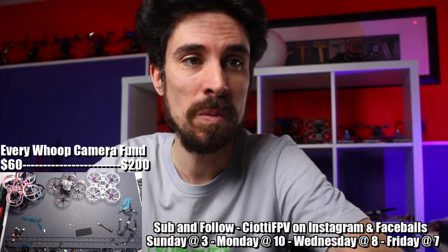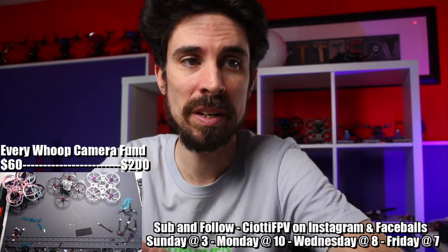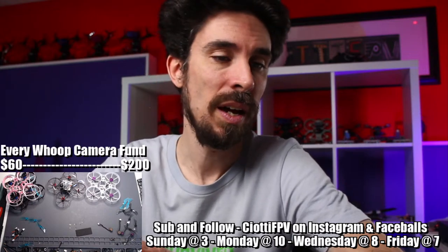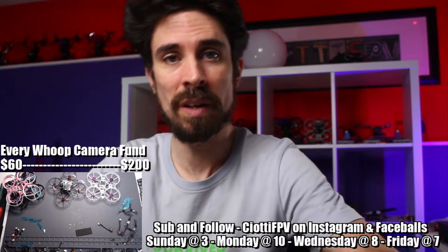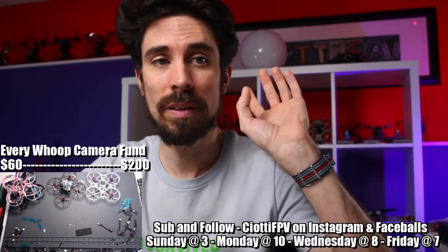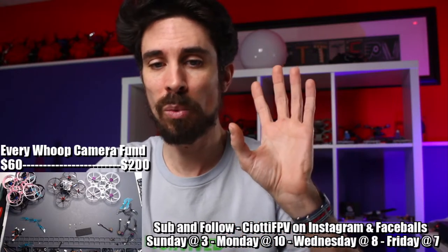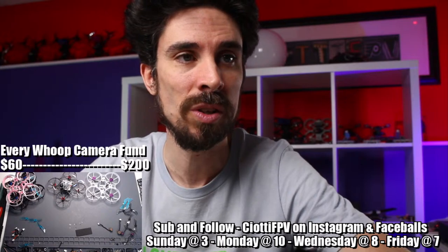Gray Hat says, what's wrong with the Super Bee? It just fails. It's just fragile. It blows up. Original Super Bee did have ESC issues, but I've heard from so many people that even with Blue Jay 0.16, they're still very fragile, and they still let go. You have to get Blue Jay 0.16 onto the Super Bee AIOs. Without that, they have all kinds of problems, but even after you do that, they still have issues.